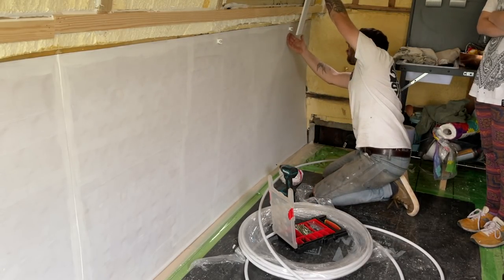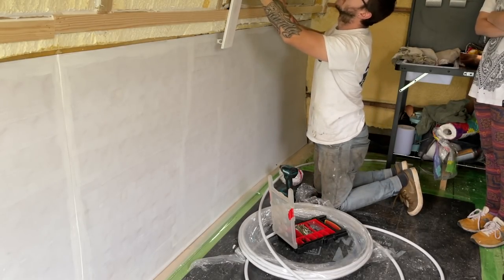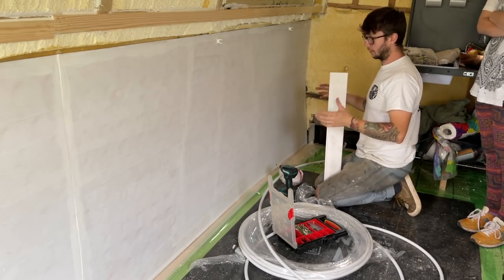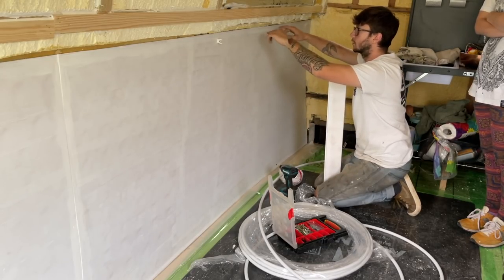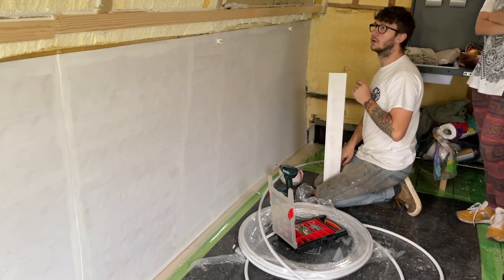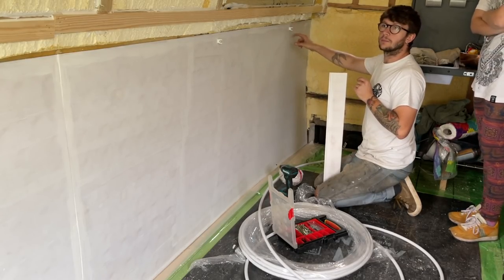Yeah. And the water needs to be at the bottom, so we're not doing this the right way around. We just need to check this. What do you mean it's under the bottom? The water you want, basically, because if the pipe bursts, it's going to spray everywhere, but if it's dripping, you don't want it dripping onto your electric, so the water pipe is the lowest point and electric goes above. That's not very big space for the electrics. What, up above? Yeah, but it's not that much that needs to come up here.